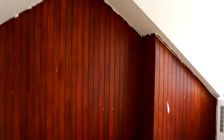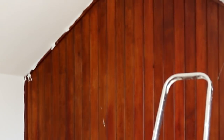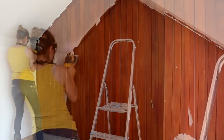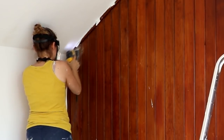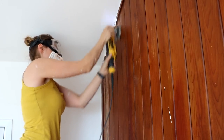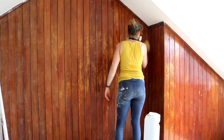This is how the room looked before — we'd never done anything to it until now. You can see a bit of white paint runs because we painted all the walls. I've been dying to paint this tongue and groove wall. This is my Dewalt Multicutter — Manu Manu kindly sent me this, so I'll leave a link below. I'm using the sanding attachment to key the surface before painting, and then using a damp sponge to remove any dust particles.